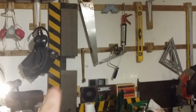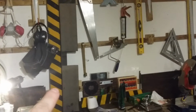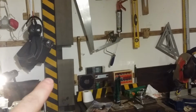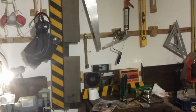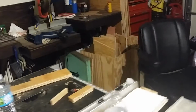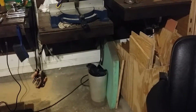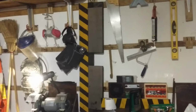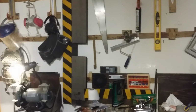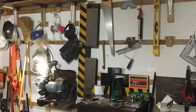But it helps me get nice straight cuts on panels, and that is important because if you don't get nice straight cuts out of your big sheet of plywood, nothing you cut after that is going to be square. I have a very nice Porter Cable circular saw with a laser on it, and the laser is really good. I snap the chalk line and put the laser on the chalk line, and it cuts very straight. It does not cut straight enough. The door board is pretty much like having your own panel saw. If you don't want to build a door board, you can go to Lowe's and they have a panel saw in the back of the lumber section, and they will cut your panels down into the size that you want.